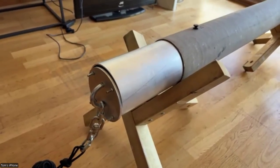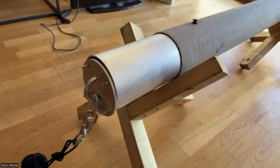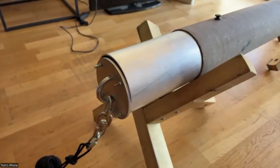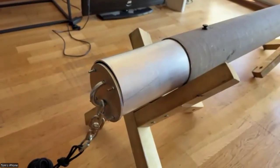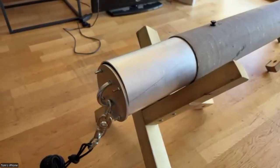So at the moment we're going for one ring of 8, and if you're both happy with that, unless you've got any other ideas, we'll just go ahead with that. I think that's fine, especially since you're saying those rods that I see protruding from your forward top plate go into the motor. They go into the forward closure, and the forward closure is attached to the motor. So it's retained vertically on the rocket instead of in shear. What I'm looking for is good adhesion, a good connection from that harness through your motor. Yes. The tube is then just bolted on there so it doesn't rotate. Yeah, that looks good.